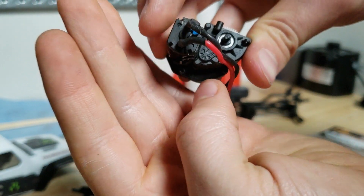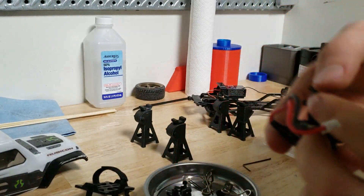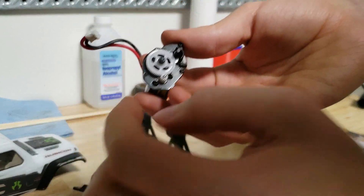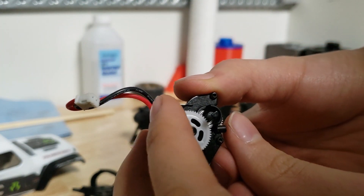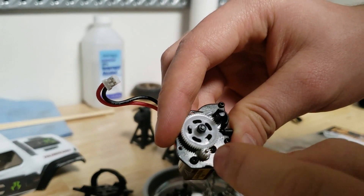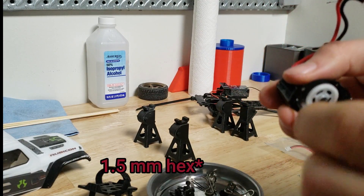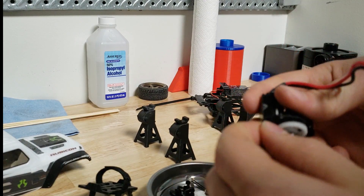There is a screw here and a screw there. Hopefully that's all the screws, but let's take them out. That cover just comes off and then that exposes the gear on the motor and then the spur gear. So you should just have to remove these two screws and then put this gear on the other motor and then bolt everything back together. It looks like the motor screws are one step bigger, so you will need these - yep, that is the correct size and they are shorter.